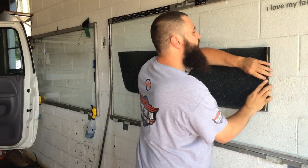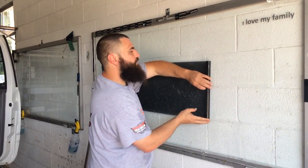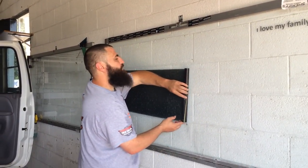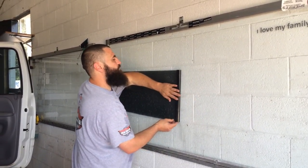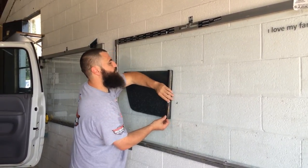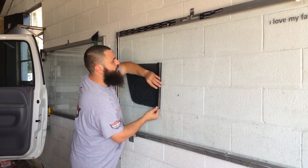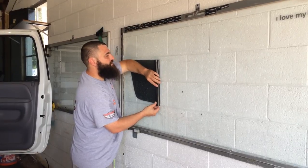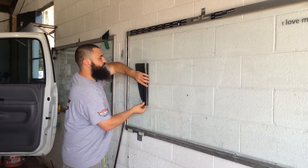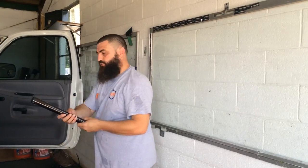If you do flat glass work — even if you don't but plan on it — you'll want to get good at doing rolls. With flat glass film you'll normally have dry adhesive, so you can skip one of the steps you use on automotive film because of the pressure-sensitive adhesive. A lot of people say to roll it up as tight as a pencil or something, but you don't have to roll it super tight — just whatever works for you, and a lot of that depends on the film.